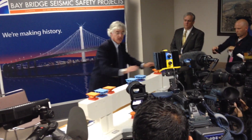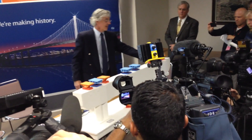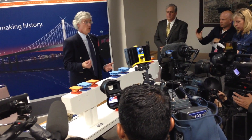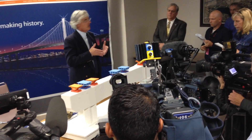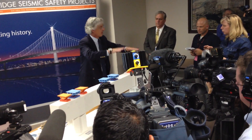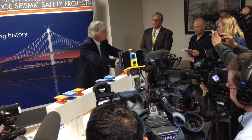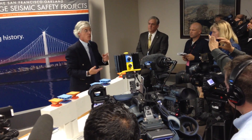A box sits over here. The orange elements here — those are the bearings. Dr. Nadir and others on his team have designed these. Bearings are really, really tricky things on a bridge. In my experience, the two hardest things to design and maintain on a bridge are bearings and deck joints. What's tricky about a bearing is it's a bottleneck of tremendous stresses. Imagine a bridge 25 meters — about 75 feet — across, with its self-weight and trucks, etc. All of that weight has to funnel right down through these two bearings. Not only do they have to carry tremendous concentrated load, they also have to allow for movement.